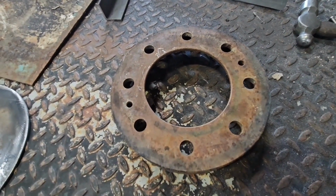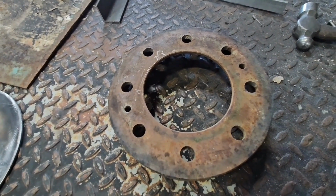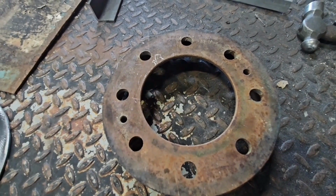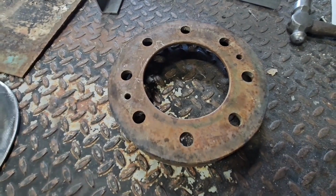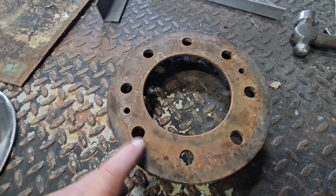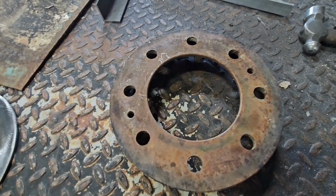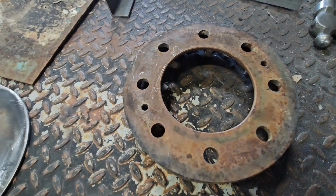To cut it, I just used my cutting torch. I went out back, found a brake rotor that had a hat that was 8 5/8 or 8.5 inch OD, and that's just about perfect because your torch ain't gonna fit in there tight. And I just used a cutoff wheel to cut the rest of the rotor off, and I'm gonna keep this because I got two more pole mounts yet, and might need it someday to cut some more caps. So anyway, later.